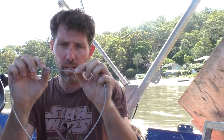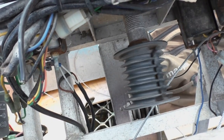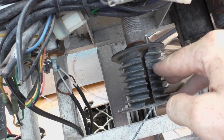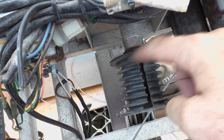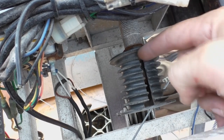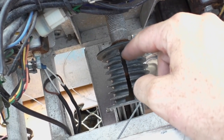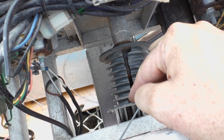Once you've found the middle of the cable by folding it in half essentially, I'm now going to lay this centre part lengthways down the groove along the centre of the drum. Here's the drum here on the end of the helm — it's just on the shaft of the helm, it rotates, and what you'll notice is that it's got this spiral groove coming around it and then this straight groove down the centre. The very first thing we need to do is take the middle of the cable and lay it down this straight groove.